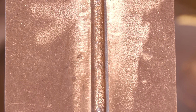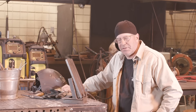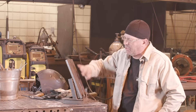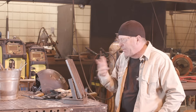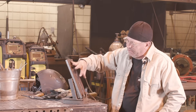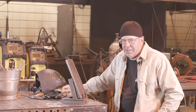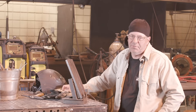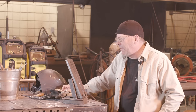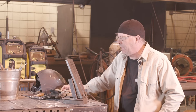We've now created this set of half-inch coupons for our experiment with our downhill rod. This was kind of a weird fit — we were prepping some material and had a strange situation where it was real tight here, real wide here, and real tight down here. It's because one of these plates is bent. Recutting it really wasn't going to do anything. I did slam hammer it over on the anvil, but it didn't do anything because it's half-inch thick.